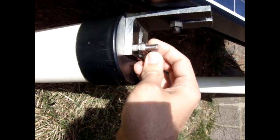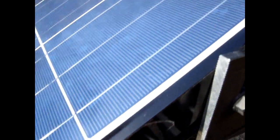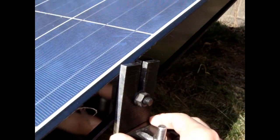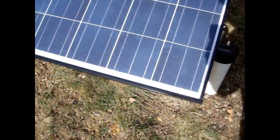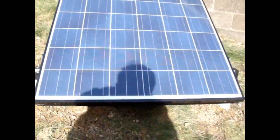I did need to also buy these bolts — they're about 75 cents to a dollar with a nut. You can see how the Westinghouse panel has the built-in groove, so you can just mount the L bracket right to the panel. You don't need to buy any solar rail or anything like that. You just want to make sure when you put these in, you get them nice and level.